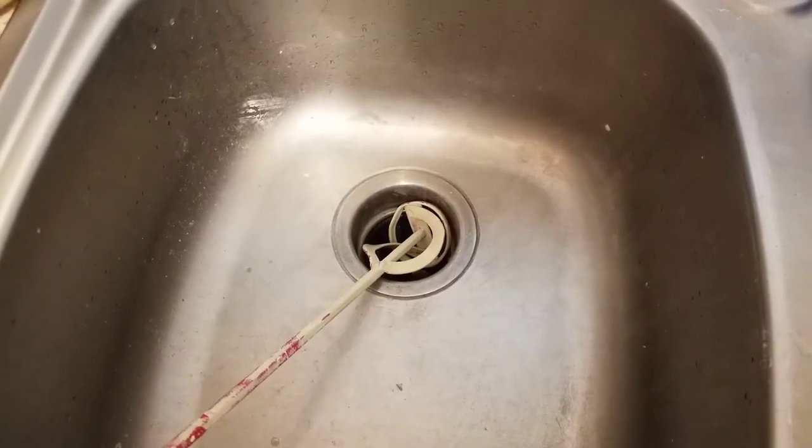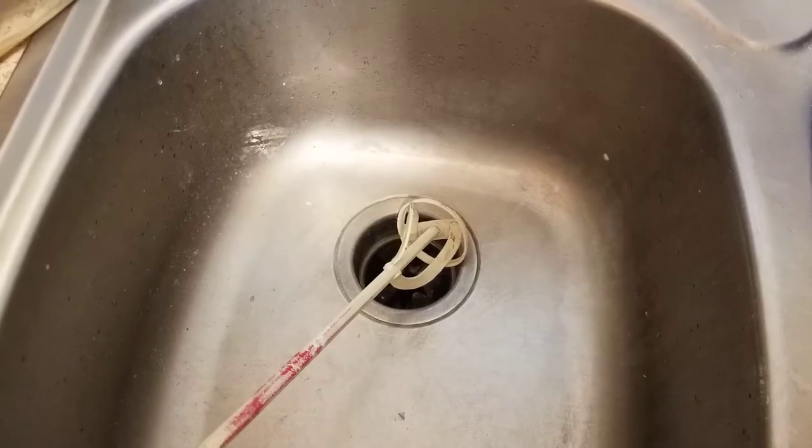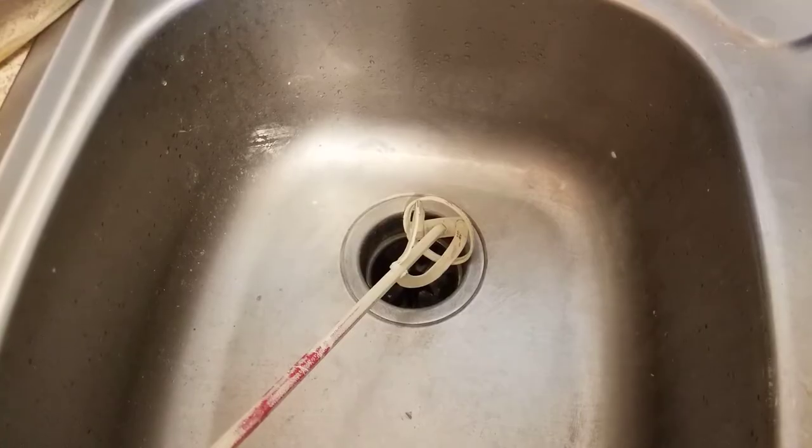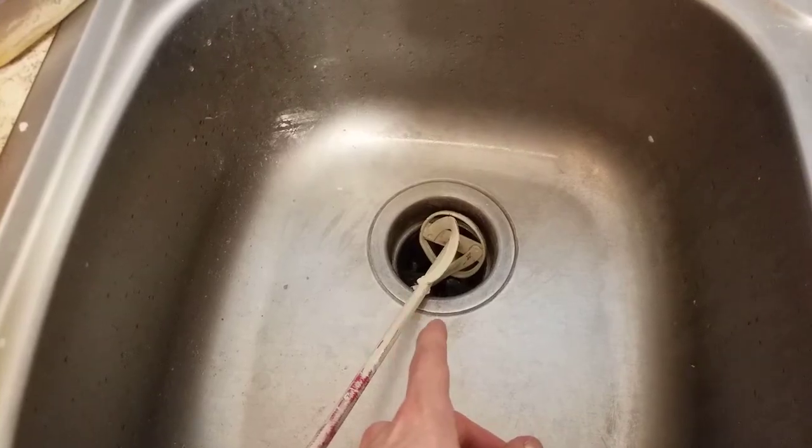When you're done stirring, it's important to also rinse your stirrer in the sink. If it's a latex-based paint, rinse with water. If it's an oil-based paint, fill some mineral spirits in a bucket and wash the stirrer around in it. You don't want dried flakes of paint getting into your fresh paint.